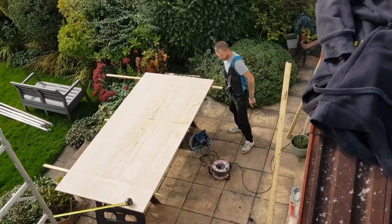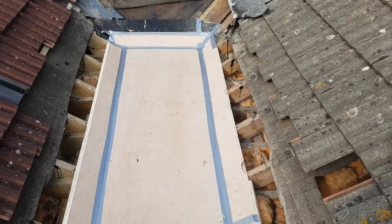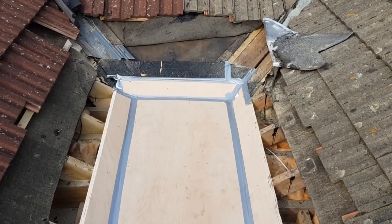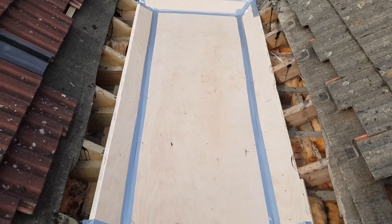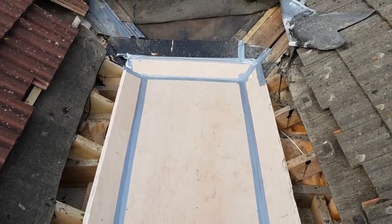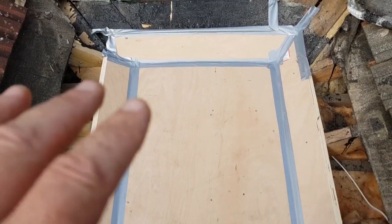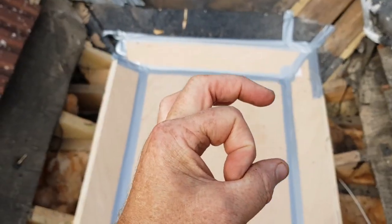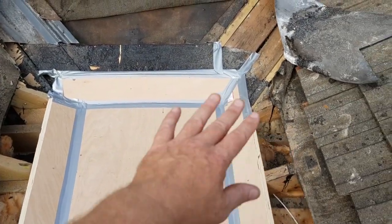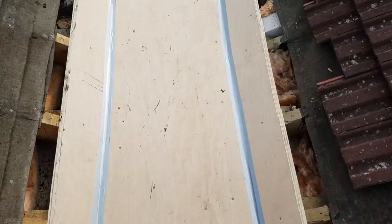The whole box gully is now decked out with 18mm exterior grade ply, with a chamfer all the way around. I've taped all the joints with duct tape or gaffer tape so we don't lose too much resin through the joints. If you get a crack, resin can run through and leave a dry spot on the fiberglass, giving you a little white spot. You can also get an air bubble or heat bubble that blisters up. Sealing all cracks and joints saves on resin and prevents dry spots and blistering.